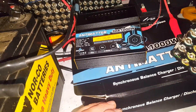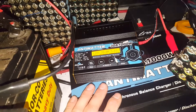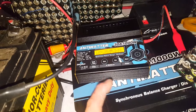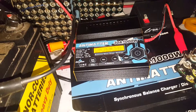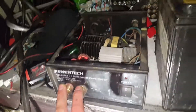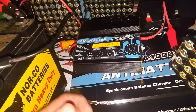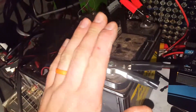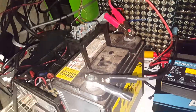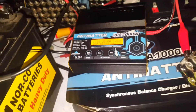If you're going to buy a LiPo charger, don't bother buying anything else. I did get sent this for free from BangGood.com for the purpose of a review, and I've got a deal going on with them. I highly, highly recommend it — if I get more things to test I'll buy a second one. I'd recommend a serious power supply like a 40 amp 13.8 volt or a 24 volt 20-amp switch-mode supply to run it, as this unit has huge potential. If you don't have big power, grab a decent battery from the scrapyard, trickle charge it, and then put out bulk power with this. The regenerative discharge mode — RDC — is the best thing ever.